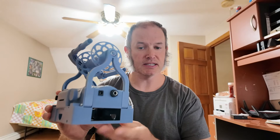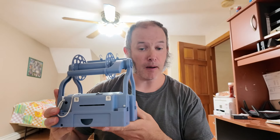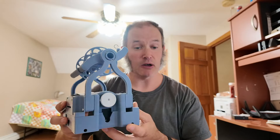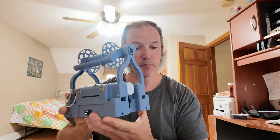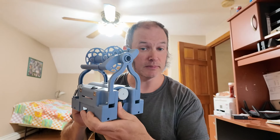This prototype is 3D printed, but the final version will be injection molded, and that's a big part of why my prices are so affordable. Injection molding makes products much cheaper as long as you're making several thousand of them, like I do. Injection molding also results in stronger parts and parts with better surface finish. So as long as you're making a bunch of parts, injection molding is going to be a big win over 3D printing.